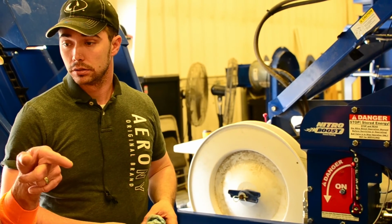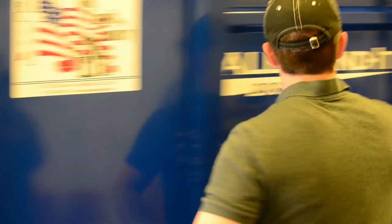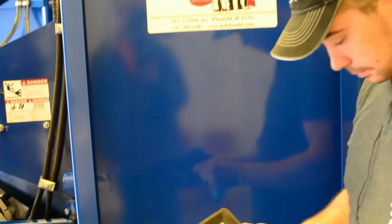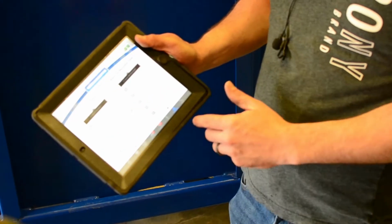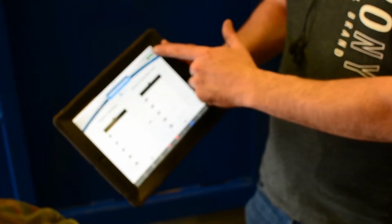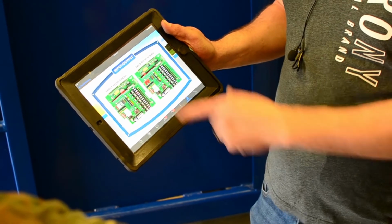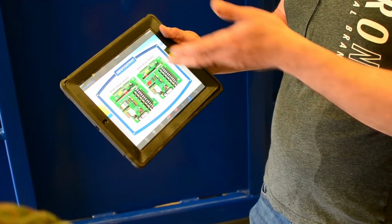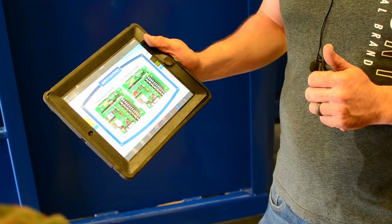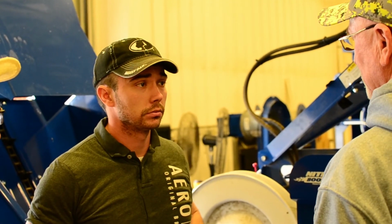Can you see that box on the iPad? And you can see the lights going on. So I go over here to troubleshooting. I had already had it pulled up. This is the troubleshooting page, right? And now since it's synced up, I've got red light 10, 11, 12, and I've got green light 2 and 4. So it's telling me right now the energized state of number 2 is vertical swing open. I know that if I lose power to DIN connector 2, that vertical swing is going to go closed.